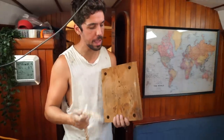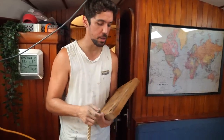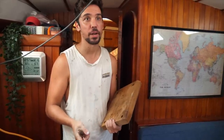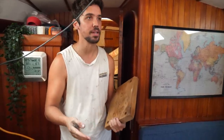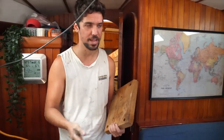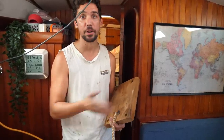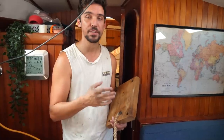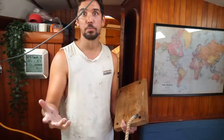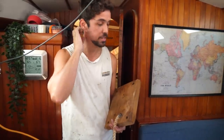So one of the things we've got to put back, which we're probably telling a lot of you how to suck eggs, and apologies if we are, is one of those things that you do it, you forget all about it, or the boat came like that and you don't even know to do it, and then you hear a story about someone who didn't have it or forgot to do it and they have an accident, and it is a bad accident. What can happen is when you run out all of your chain through one reason or another, if it's not attached to the boat at what they call the bitter end, you can lose your boat. It goes wrecking ball through the marina or through the anchorage and then ends up on the rocks.